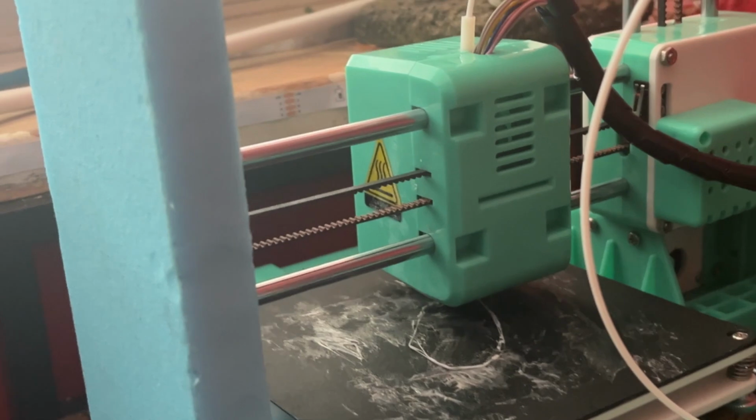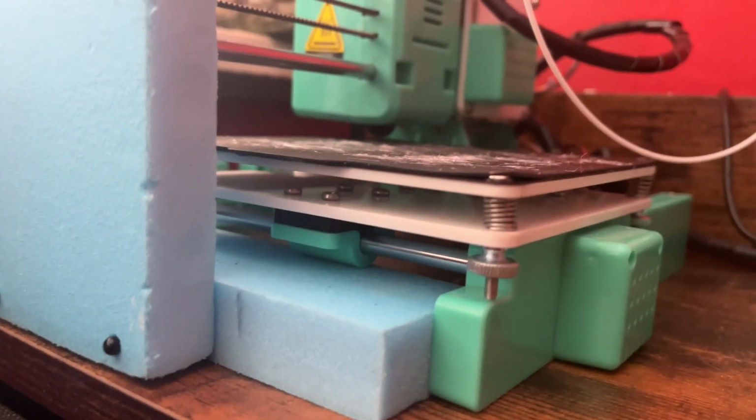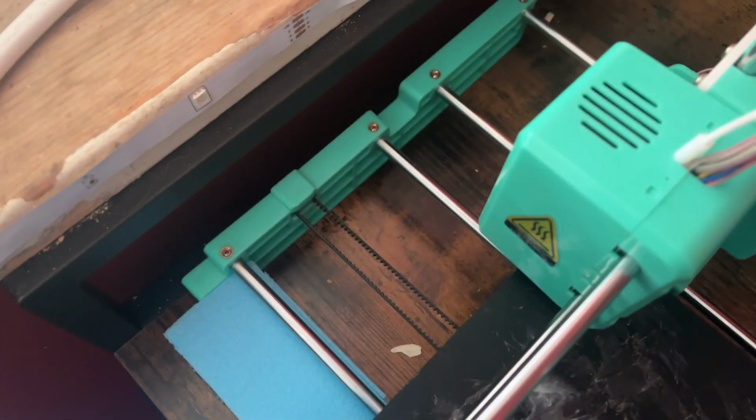It turns out that the bars, as it moves back and forward, you just undo the casing and slide them, so they slide out and you slide them till it's tight. But it took us 90 minutes to work this out. The belt underneath, you have to take the plate off. There are two screws inside there that were completely loose, barely holding anything together, so we took the head off and spun it round and tightened it, and now that is tight.